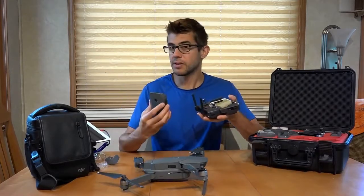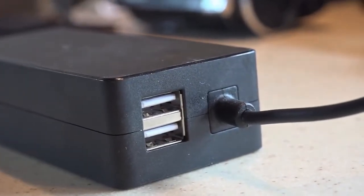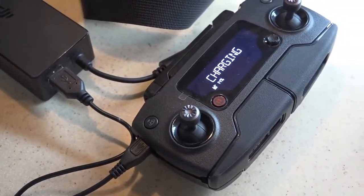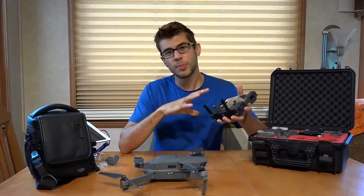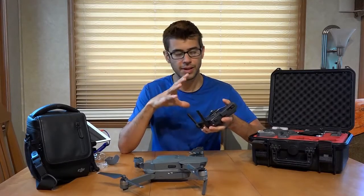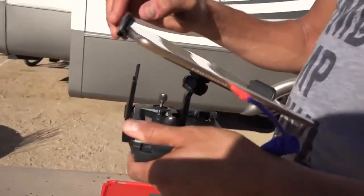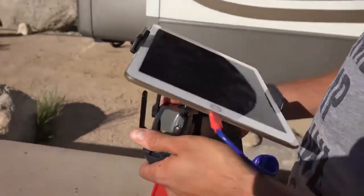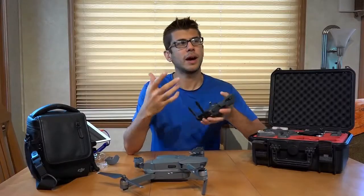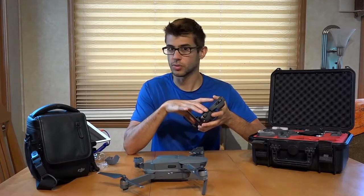The controller is designed to connect to another device via a full-size USB port on the bottom, and we use a little coiled USB connection to plug the iPad directly into it. It connects to the DJI Go app just like if you were using a phone, and it really works well. The controller is rechargeable — the same charger for the drone batteries also has USB ports to charge the controller through the same port the phone plugs into. The battery life isn't bad, but because it has a relatively powerful transmitter, the controller can get warm during long-range flights and the fan will kick on. I normally see maybe five to eight flights before needing to recharge the controller.